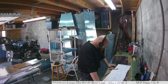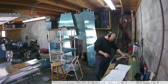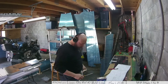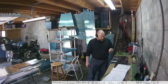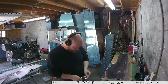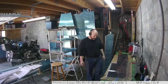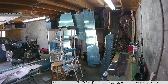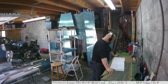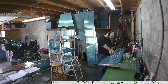Here I'm measuring and then scuffing the inside of the skins, and bending the tip up a little bit. Scuffing the inside of the skins with some sandpaper because it uses some foam ribs that you use on the end there. I don't know why they use foam, but you have to scuff it a little for the tank sealer to glue those foam ribs to. Then cleaning the debris off. Every time you see me pull my iPad out, I'm actually tracking hours.